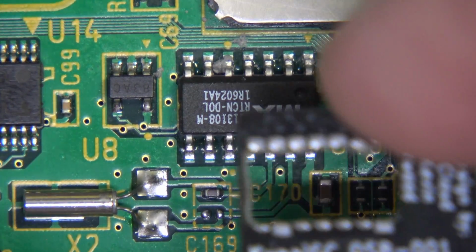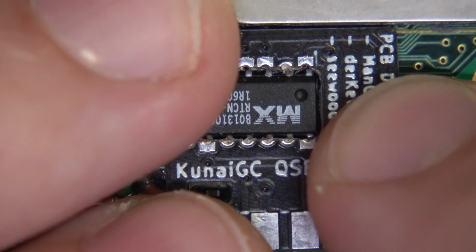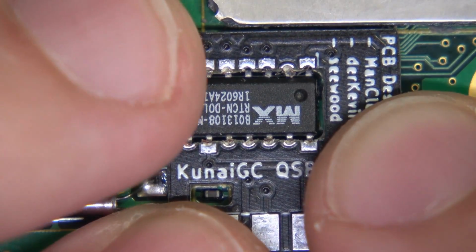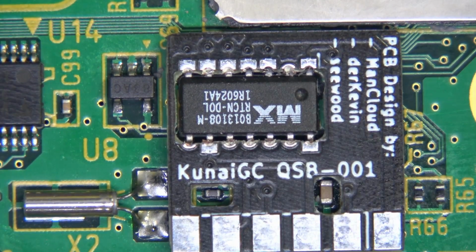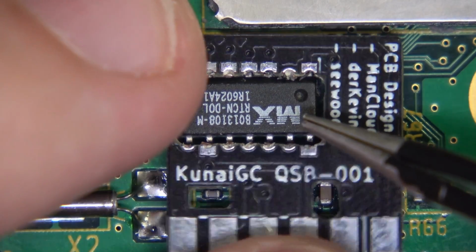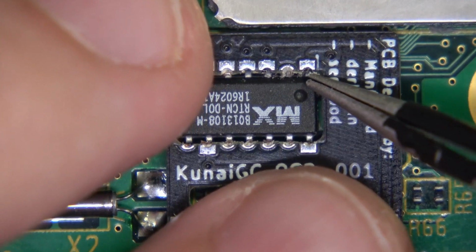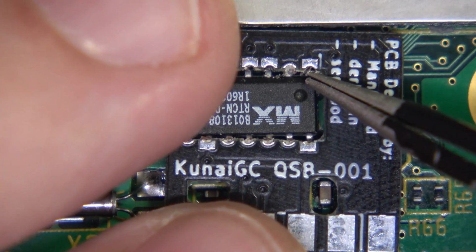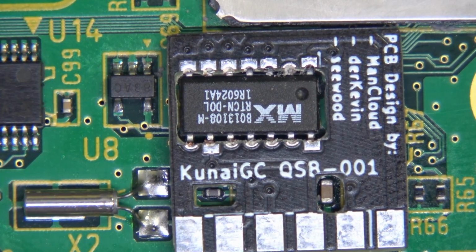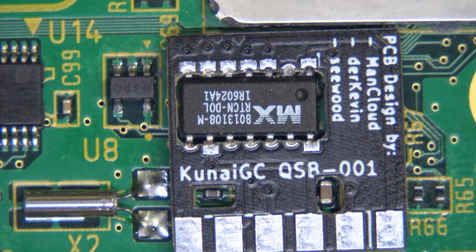All we're going to do is carefully fit this over and make sure that this is lined up appropriately to all of the pins. Now again, the fitment here is great, but you will notice some defects as we just discussed with these castellated edges where the plated through holes have been damaged and they're slightly disjointed. Just keep that in mind when lining this up, and you shouldn't really ultimately have any problems, but the factory definitely can fix that and make that look a lot better.